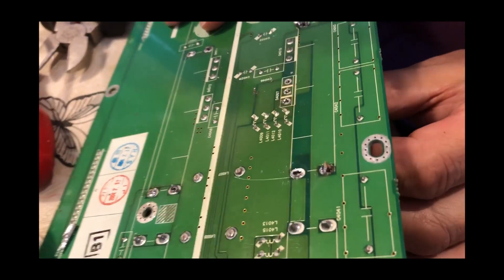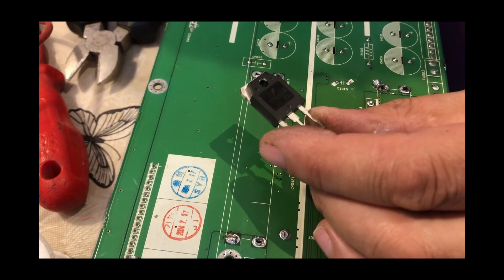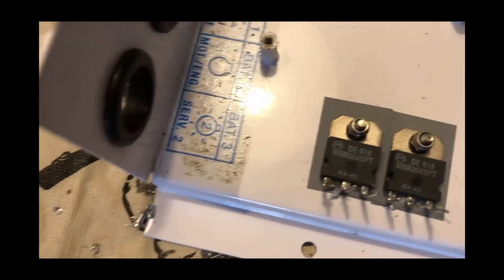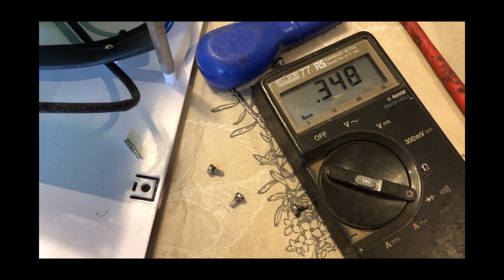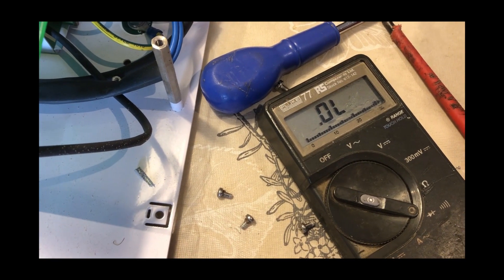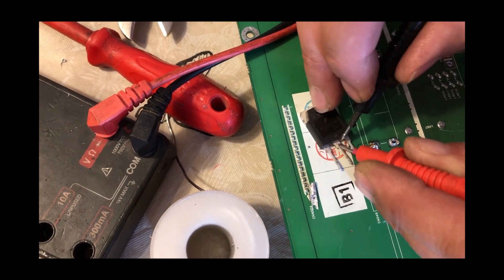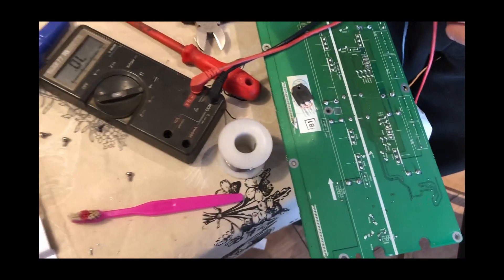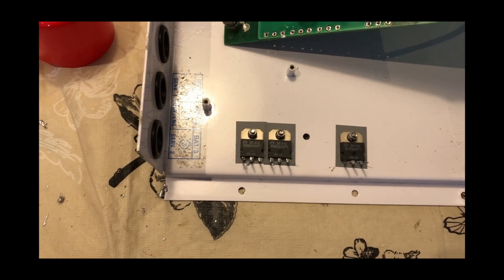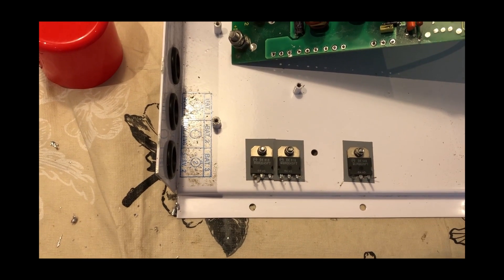Okay, hopefully that should be out. Yes, perfect — one diode. It's time to test this diode. Yeah, that's giving us a perfect reading. Okay, so this diode is looking good. There's no short — it's doing what it's supposed to. So we're happy to have a go at swapping this diode now and re-put the board back together and solder it all up, and hopefully it works.